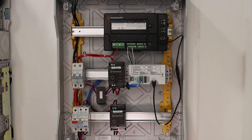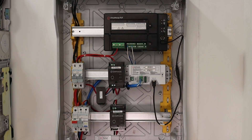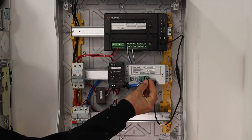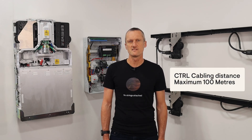The CK2 is connected to IQ batteries using two-pair shielded control wiring as recommended by Enphase. Connect the control wiring into this header port; the adjacent port will have a resistor plugged in. You will always need one resistor at the first device and one resistor at the last device in the control wiring circuit. The communication control wiring has a maximum distance of up to 100 meters.